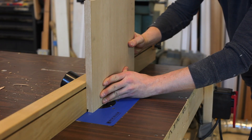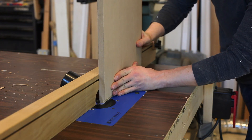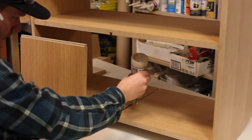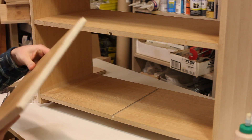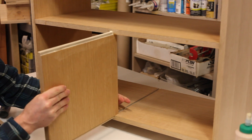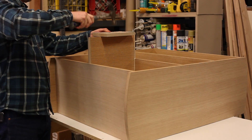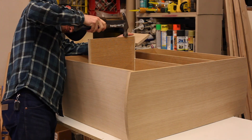Now I'm going to put the dovetail profile in the partition. Since it's MDF, I had my doubts about whether it was going to work, but it ended up being kind of alright. When I tested the partition, it slid pretty well into the dovetailed groove, but after I applied glue to it, it swelled — that was an oversight on my end. I had to get out my hammer and drive it home. It's not something I really like doing with my furniture, but nothing broke and it ended up being okay.